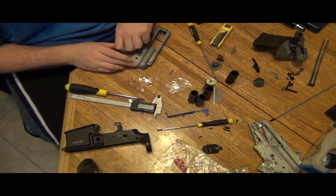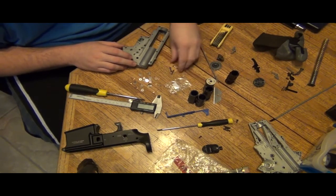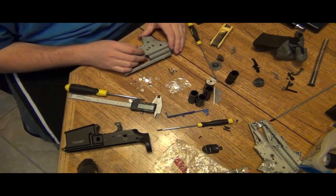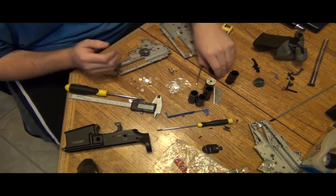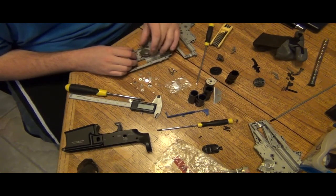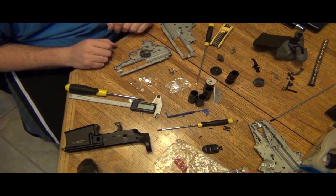So we have started with the sector gear first, mainly because I wanted to get the cutoff out of the way. We can start with the bevel first, but we're just working with the sector, and then we'll work with the bevel in a minute. The sector will have to change a little bit depending on when we pop in the spur gear. So showing this way is going to be very helpful, because you could start with the bevel gear if you want to first.